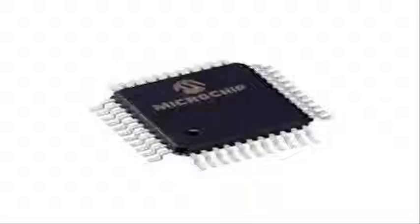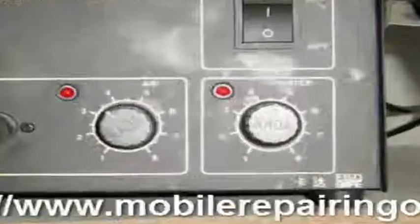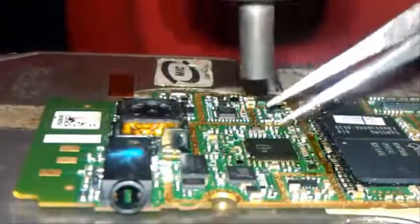Microchips are usually not used in modern smartphones, but they can be seen in the picture. To remove microchips, your heater should be on 4.5 and air should be at a normal mid setting. Remember that you must revolve your heat gun while working — do not keep the heat gun at one position; it must be moved or revolved.